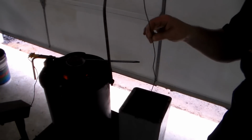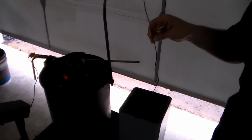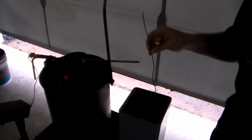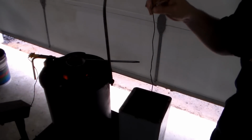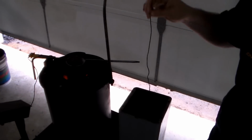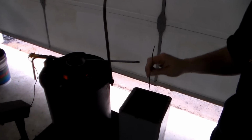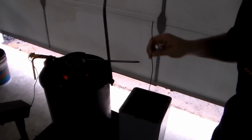And so with that kind of brittleness, with that high hardness, if we take it in there and set it on that machine and let that diamond penetrator push down into the steel, we put it at a very high risk of fracturing it, of causing cracking around that diamond point, which obviously we don't want to do.